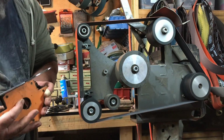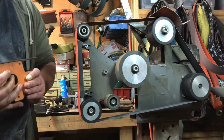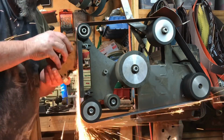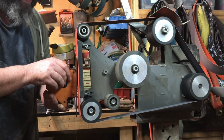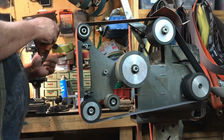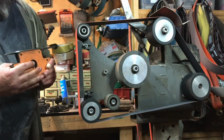Today we are taking those little custom knives through to grinding stage. So we're going to grind on the bevels and get them up there. Now what I'm starting with is, because these knives are having a full grind on them, I need to work the flats first. We already did it at 40 grit when we were cleaning up after heat treatment, so we're starting here at 120 grit,